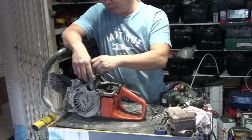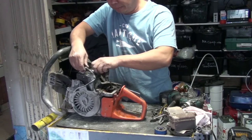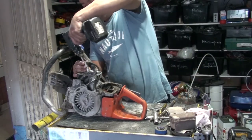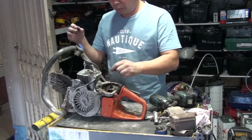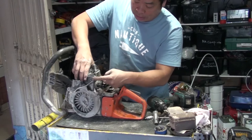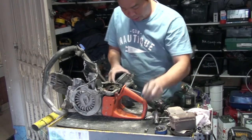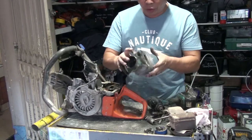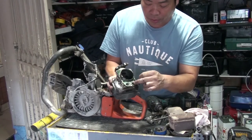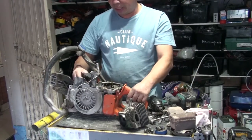Before taking the head out, remove the spark plug. So go. Bang! Like that. Don't break this, be careful. That's it. The whole piston out. Keep this one, we're going to use that one again. The story is here. See the paper grit here? That's why they suck dust and water in here, and they damage the piston, cylinder, everything here. See the piston? All worn out.